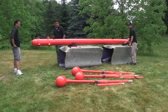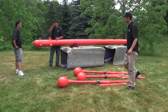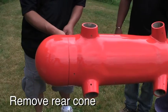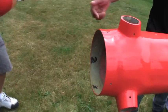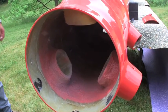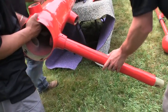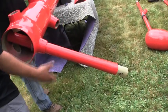Next we are going to be installing the arms of the bird into the fuselage. All the parts are numbered so you can easily see which parts go together. The first step is to take the back cone off the bird. Look at the holes for the arms and you will notice that they are labeled so you know which arm to install in which hole. Next put in a strut. Take the back cone off the other side of the rod, but don't tighten it as you need some slack to make the connection with the main part of the arm.